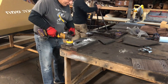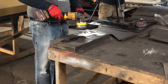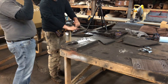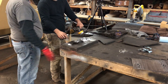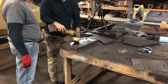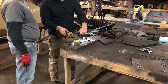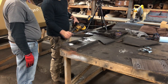So Richard hands me the grinder and says, okay, hit it, go clockwise with it. Why clockwise? So the reason we go clockwise is the disc is rotating that way. And what we're trying to do is knock the dross off — it's only really attached right at the edge. So if you approach it clockwise with the grinder tipped a little bit, you're going to impact that dross in a way that it flicks off the piece. If you come in the other way, you're trying to drag it onto the piece, but it's only attached to the edge. So you want to flip it away.